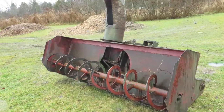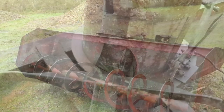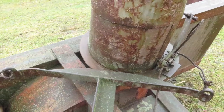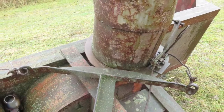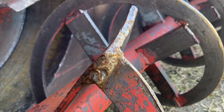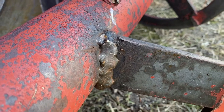This is an eight-foot-wide snow blower that I refurbished — it was just dumped in the bush, nothing much working on it and a lot of parts seized. The welder came in handy several times: I had to rebuild the whole mechanism for swiveling the chute hydraulically, and my MIG welder was useful for welding lugs onto the outside of the chute so I could put a cable on it to move with the cylinder. More recently a small tree caused a corkscrew auger piece to break, but about an hour with the welder and it was all fixed up as good as new.